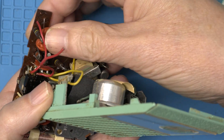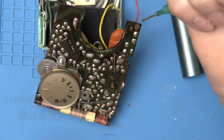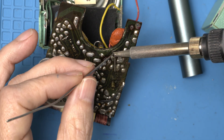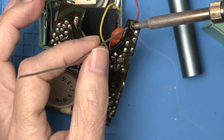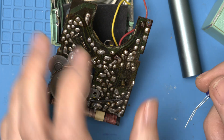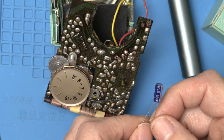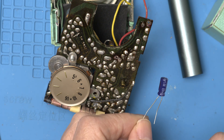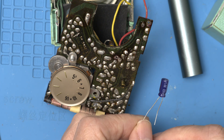I can put a little bit of putty here to help hold that in place. Now let's get the hundred in place. That's going to be a little bit trickier because we're going to have to use some heat shrink tubing so that we don't touch any other wires — that won't be too hard. This is a radial cap, where both leads come out the same end. We're replacing what were axial caps, where the leads come out either end, so a little heat shrink tubing should fix that.